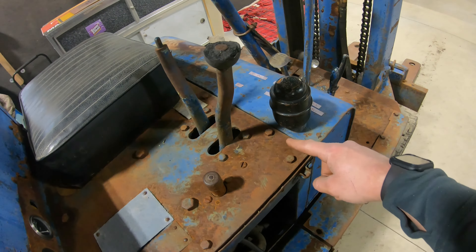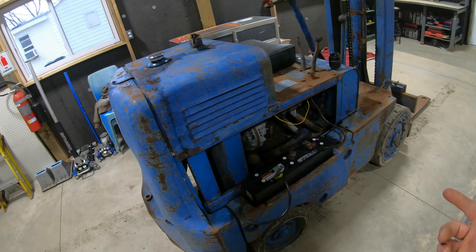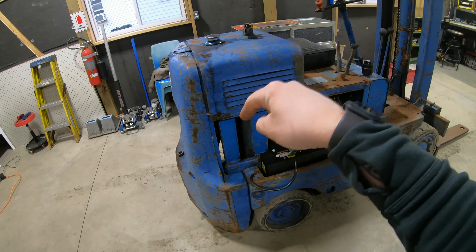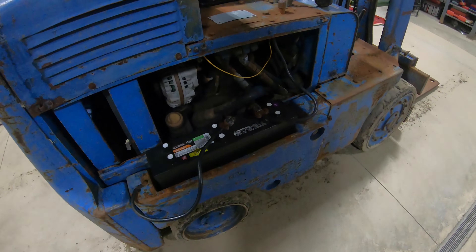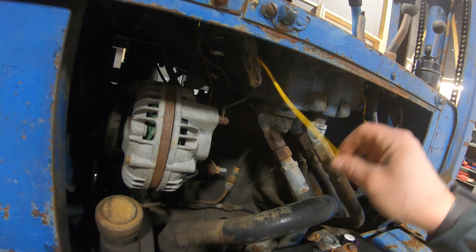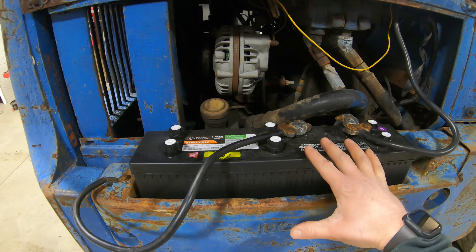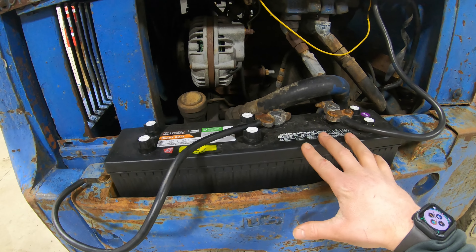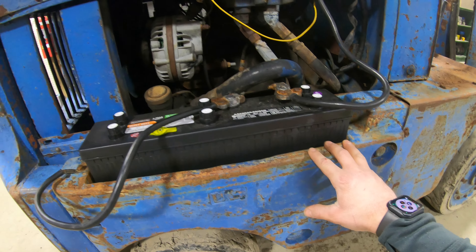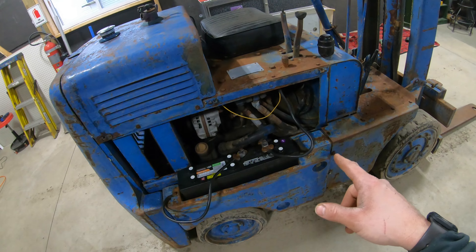I'm hoping I don't have to take this last cover off because some of these bolts might snap. I've had this forklift for about three weeks now and have been waiting to do a video before doing any serious work. The only things I've done are get a new radiator cap — it's a non-vented cooling system, so coolant just drips out a drip tube onto the ground. I also bought a battery. This was a six-volt system, and somebody converted it over very sloppily — wires hanging everywhere — but someone did convert it to 12-volt. I found a long-style 12-volt battery at Tractor Supply that fit the battery pocket perfectly.